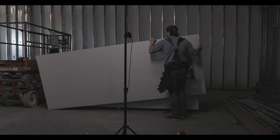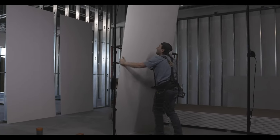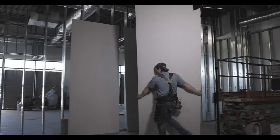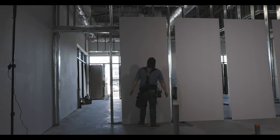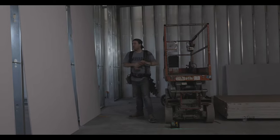Here I am lifting up the sheets because what I'm doing is standing up all the full sheets before I start screwing them in. I don't care if there's a hundred — I'll still stand up all 100 before I start screwing them in. I've got my layout checked, I know where I'm going, and I've got all my sheets stood up with 16s drawn on them.